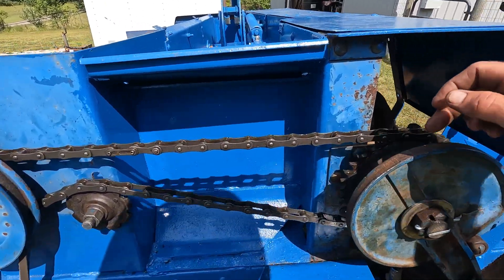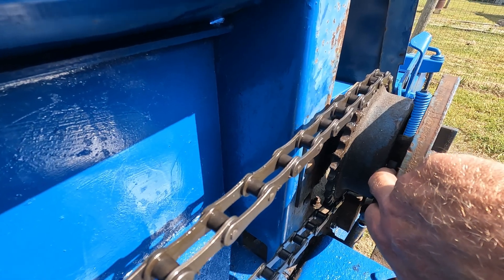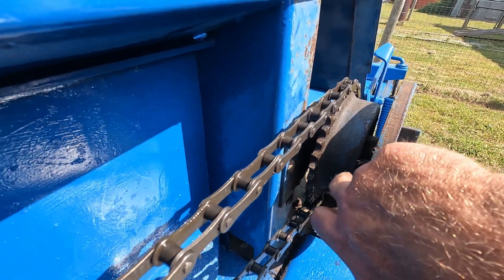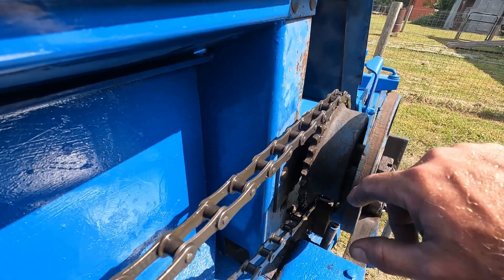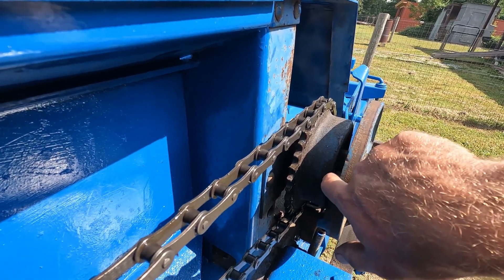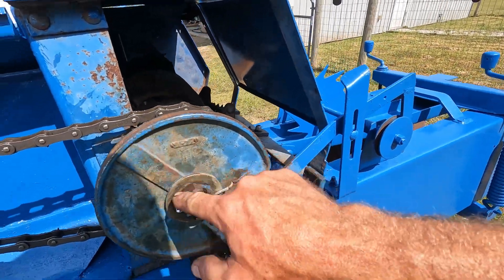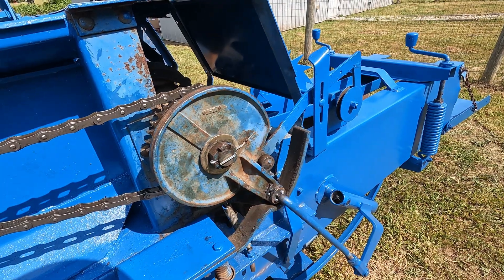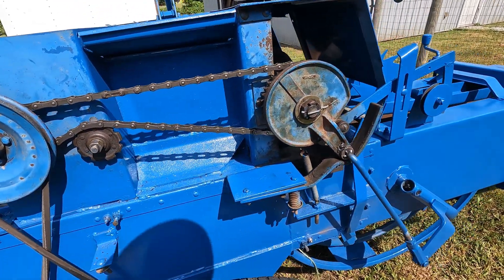Inside here, the follower pin holding the little wheel was really sloppy — when I took it apart the shaft just fell out. Luckily I have a lathe. The knurling had been flattened out making it sloppy, so I re-knurled the end and press-fit it back in, taking a lot of slop out of the system. The other pin — the hinge pin for this lever — I also re-knurled that one after pressing it out to get access, and then pressed the refurbished pin back in place.